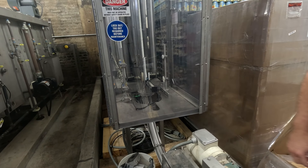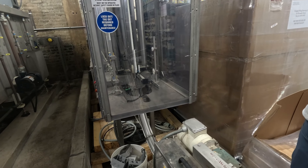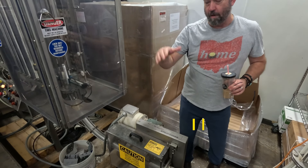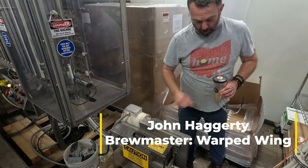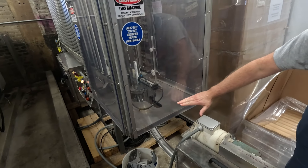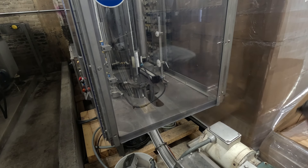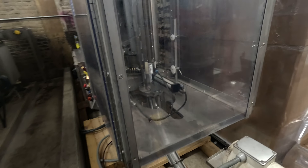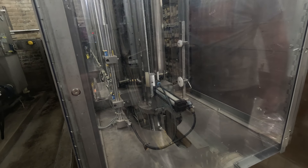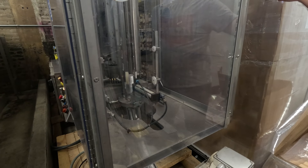All that's happening is a belt pusher with a tensioning device that's monitoring the pressure on the lid. So when it drops, the belt pusher will turn on, push them up there, and as soon as this stack drops below the sensor, it'll push the next one in. There are 70 pockets in the thing, so it'll just rotate around. The guys load it up with however many sleeves and lids they need before a run.